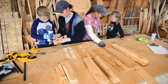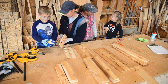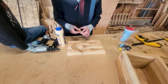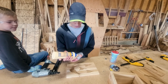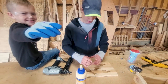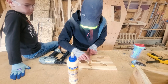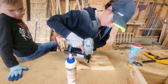Just put a little bit of glue down each of these lines — we just use a little bit. To help support this middle piece because it's just being held together with wood glue right now, we're going to take this little piece here, put just a little bit of wood glue on it, lay it across the back here, and then we've shortened our nail length just a little bit.